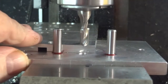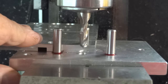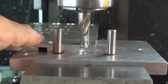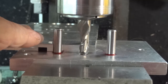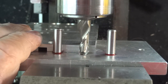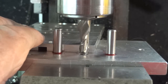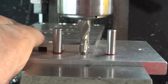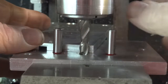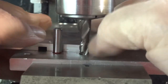Let's make sure that we're not contacting it yet. Bring it all the way down. Lock this. We've got the Z locked. Now I'll back that out just a wee bit more. I don't want to bite off too much. I'm holding this with my bare hands. We're not going to be using lead screws to adjust this under the rotary table. The only lead screw that we will be using is going to be on the Y-axis, and we'll be bringing the part in closer.